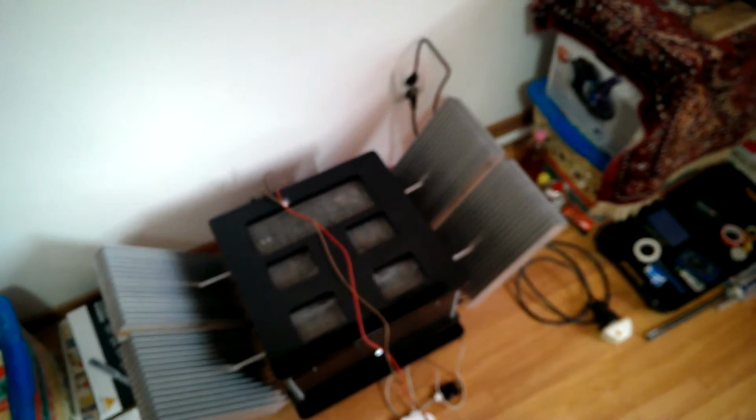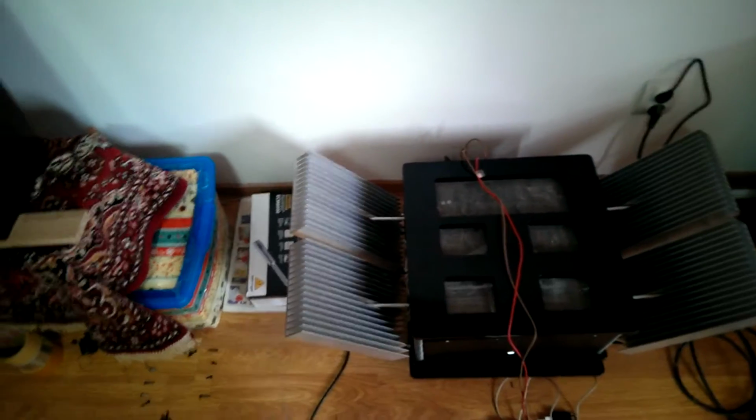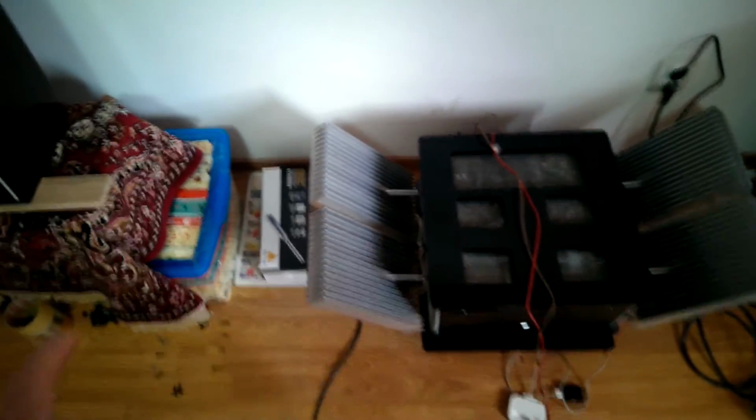I will leave it as it is till I make the other one. As I told you, my Hiraga amplifier has a blown side, has my outputs blown. I used the Sanken outputs, which have been fried on the right channel. So now on the right channel I have MJ15023 and 24, and on the left side I have the original Sanken outputs paired, matched to 5%.